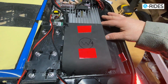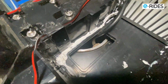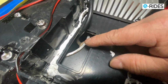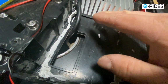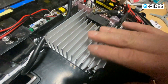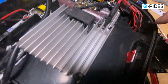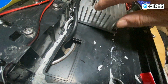So on the earlier version, this is the hollow motor, and the motor actually spins. As you can see there, if I spin the wheel, all the dirt and dust and mud and rubbish all get thrown in from here. Okay, and it all comes up. And the fan pulls all the air in with the dust as well, and that goes all over the unit. And then see the surrounding here. So it's all dusty because the dust is all coming from here, which the intake goes up.